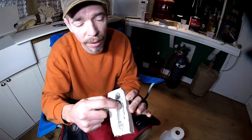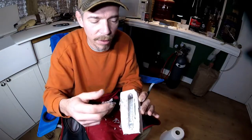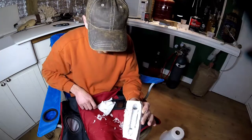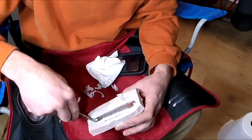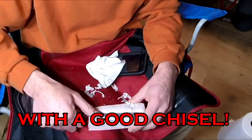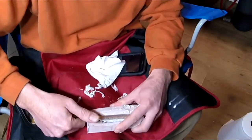So if I fill that in, that unmixed stuff is going to create a layer of uncured material. When I pour the lead in, it's liable to break the mold. So we're going to dig this out, clean it off, and then recast it. I'll show you that when I get there.